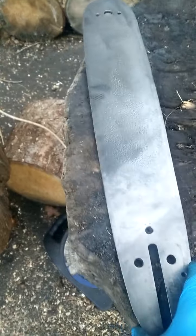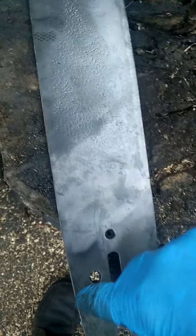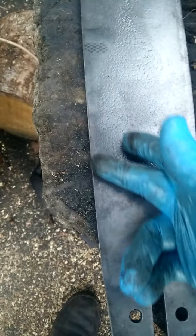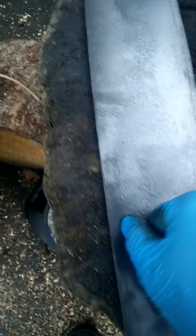This is where we currently are - and this is what we're coming from. You can see that polished tip - it's got pretty good tip symmetry in fact. What will be interesting is when we start to do a depth measurement to see how uniform it's been wearing down its length. Some bars - like you can just see here - there's a tiny shaping where the edge is just scalloping in very slightly. What would be really important is that we have enough clearance for the drive rail drive links when they sit inside, and that they're not bottoming out, because that generates obviously huge heat and huge wear.